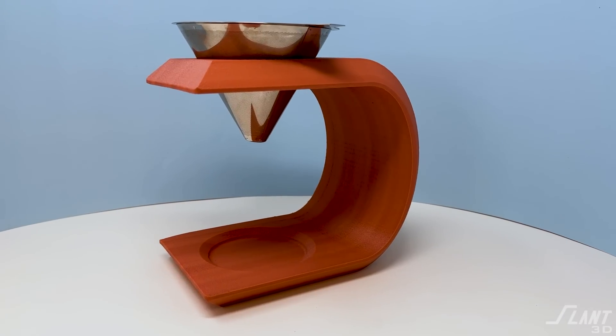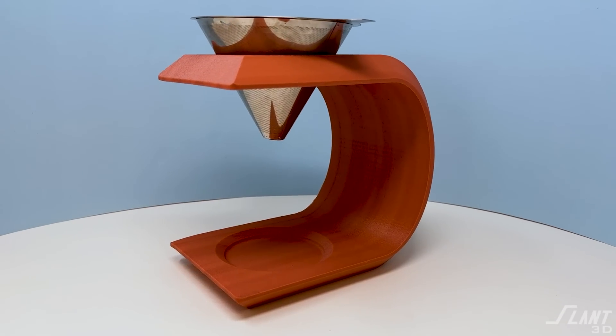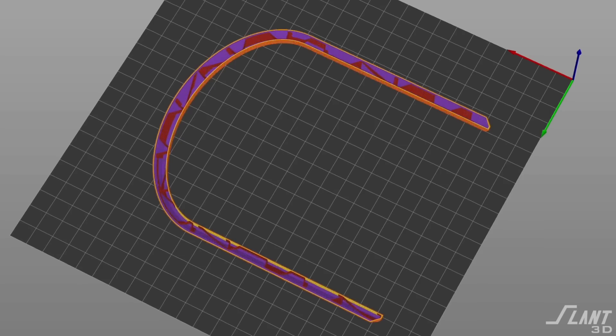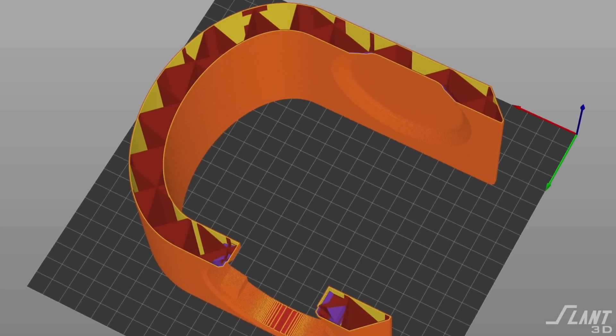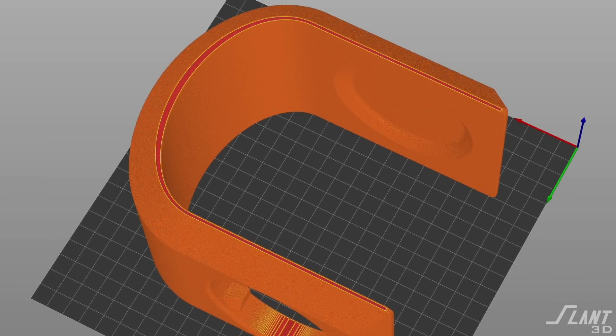This is a minimalist maker, which means we wanted to use as little material as possible. 3D printing gives us a huge benefit, because you have all of this hollow feature on this side that has a very low infill of about 3–5%. That lets you use very little material while still having good structure and a good proportion. Because if we made this super thin, it would just look weird and wonky. This chunky style, while still minimalist, makes it look like something robust and reliable that you can have around.